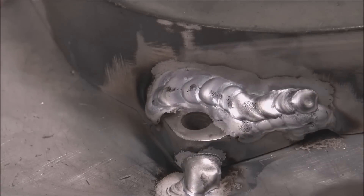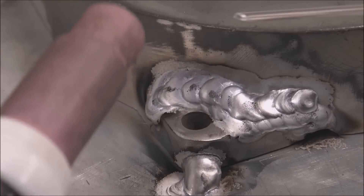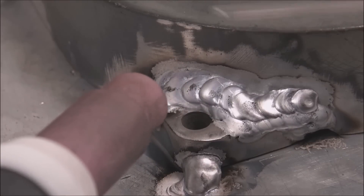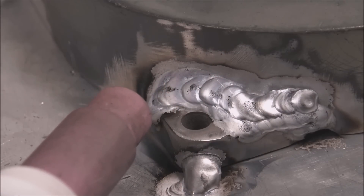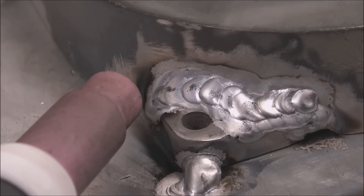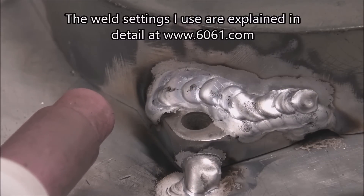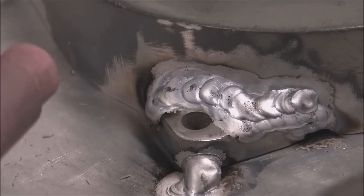You can adjust your wave balance down to clean the weld a little better, but then you sacrifice arc stability — the tip of your tungsten might start liquefying and your arc goes all to hell. Typically I like to keep the wave balance where it's getting penetration without heat coming back up into your tungsten, and just deal with a little bit of soot on top. On the website I show how I prefer to shape my tungsten. Here's also a tool you might want to get for cutting tack welds off — link in the description.